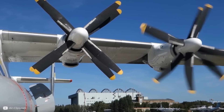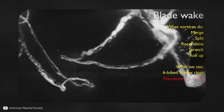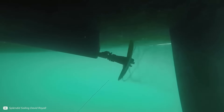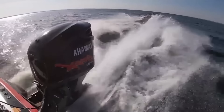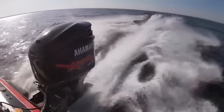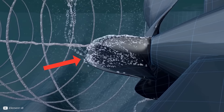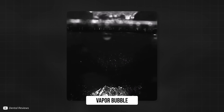Now back to the real world. Why was the Tu-114 so noisy? It's all down to the increased mixing of the airflow. Tip vortices form and collide, and increased cavitation is a nightmare for noise and excessive wear. Cavitation is the formation of vapour bubbles in low-pressure areas of a liquid, which collapse to produce a loud and damaging shockwave.